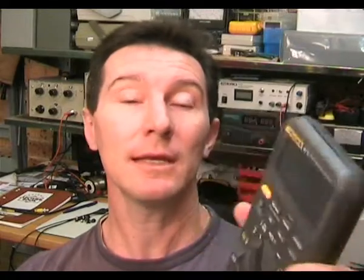The screen updating is really quick on this new model. It's four times per second in 6,000 count mode, and it only drops to three times per second in 4.5-digit mode. So it's a really fast, responsive meter — one of the best on the market.